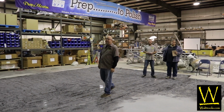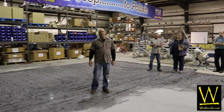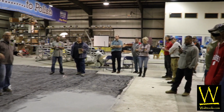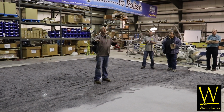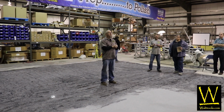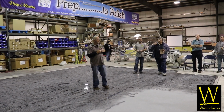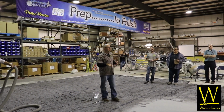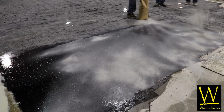You generate a lot, about a pound per square foot, and that's double broadcast. So in traditional quartz, you do your base layer, you put it down, you flood it, then you come back, put another layer of the poly on top, and then do it again. That gives you 2 layers. You do about a half pound per square foot on average, so you don't go as heavy as this. This process, because you're trying to eliminate every single spot, you overload it, you end up doing about 1 pound per square foot.